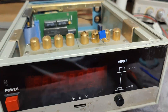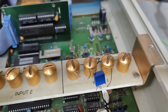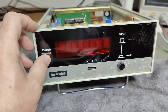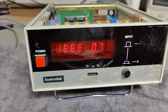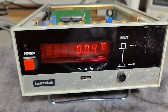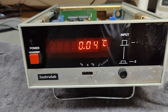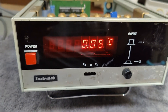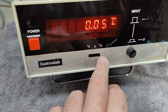So let's see what I've done. Here is a little trimmer and I adjusted this for 100 ohms for input 1. So it powers up and it shows some little test, and then it shows the address for the IEEE. And here is the temperature that it reads. So I think this is very close to zero. And this proves the unit is definitely programmed for 100 ohm RTDs. So this one is definitely usable now — I just shorted it over to Celsius using two little wires.